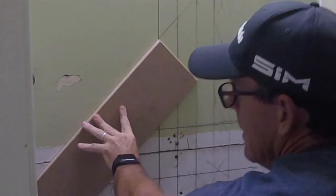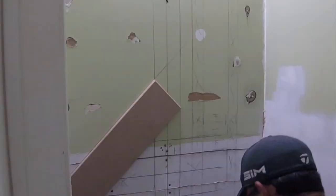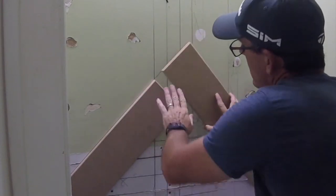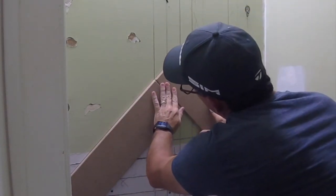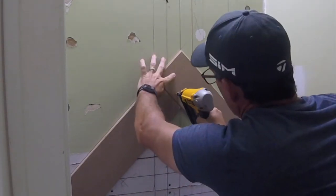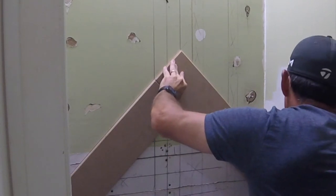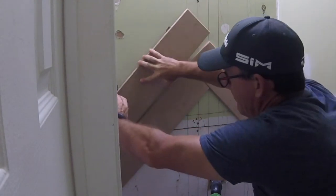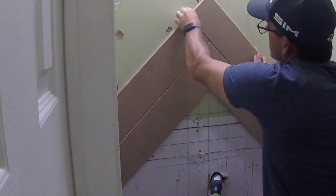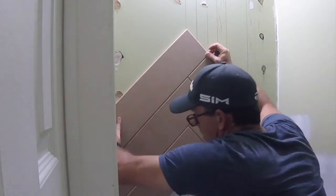When you're laying on that first one, you want to get the top point of the board right on that left line. I also marked some lines on the wall with X's — those are the water drain pipes and the vent — so I remembered where those were and didn't shoot any nails through. When you get it lined up, make sure they are perfectly flush, the point is right on that third line, then pack it in place with a couple nails into the stud behind the center and over in the corner. Once you get your first couple on and they're perfect, you just keep layering. Make sure each board is perfectly flush with the one it's joining, and keep those seams tight because that chamfer gives you that beautiful detail.